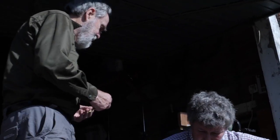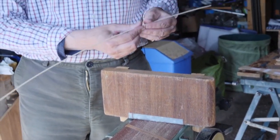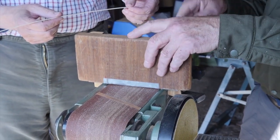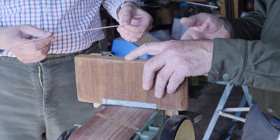Yes. Okay. So should we just show? Do you want to show us how you take that through your sanding machine to get the 2 millimetre thickness? Well, it's pretty well there, I think. But we've got the rough stringing here, and we're going to get it exactly 2 millimetres thick using the sanding machine. So what's this clever piece of equipment here? It's just a little bridge with a 2 millimetre gap, so that anything that comes through is 2 millimetres.